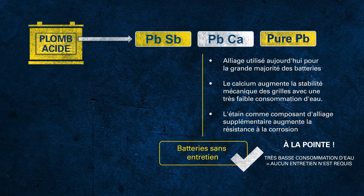Mechanical robustness is an important factor for the long life of the battery. We also add tin to the alloy in order to increase the corrosion resistance of the grids. It is indeed a science in itself to find the right composition of the individual materials. We have several chemists who are constantly working on the right alloys and recipes for our active mass.